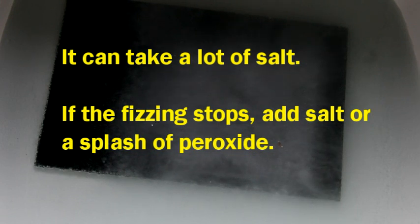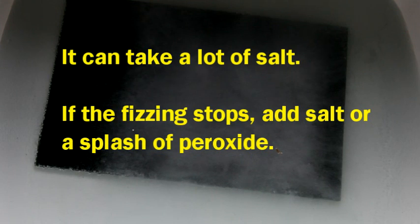And that is the reaction producing, depending on who you ask, either hydrochloric acid or peracetic acid. Either way, it's dissolving the copper into the solution and leaving the bare board where the board is exposed. In any place that the board is covered by the paint, it is not dissolved away.